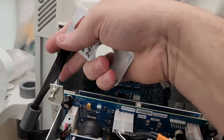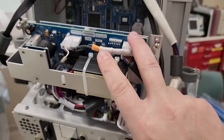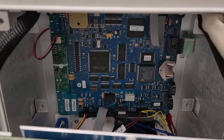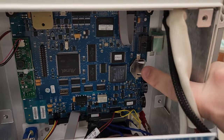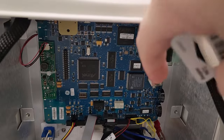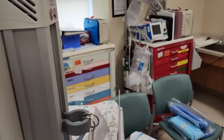And then you've got to watch these cables up here and over here. Just kind of pull them off to the side and this whole thing will just kind of fall out — it just dangles and you don't have to disconnect anything. Right here you can see the coin cell holder. So you've got to change that out. Just use a little piece of plastic from this side, push the battery off to the side, and it comes right out.